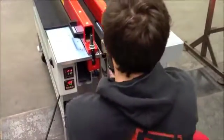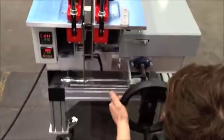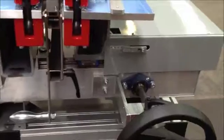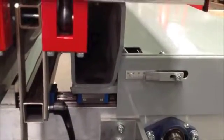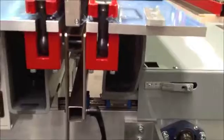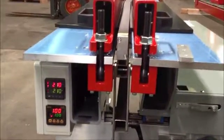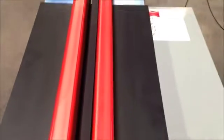After that, welding starts — he's opening the right table and moving up the heater to 210 degrees. Now he's applying on the spring exactly 17 millimeters, as you can see here on the scale. That means we are applying 1500 Newton of welding force through the transmission of the spring inside the welding machine. The first phase is about 50 to 60 seconds of alignment time, where we align and heat the material all the way through.